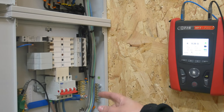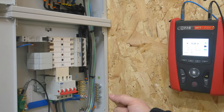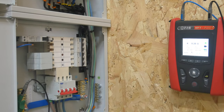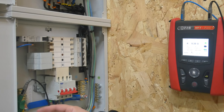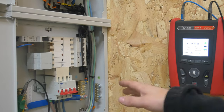It's important you do this with the jumpers on individually, not all together. So don't just clamp all of your L1, L2, L3 and neutral together and stick them to earth. You need to do them one at a time and then make sure, as an extra check, that you've got no continuity. Say you had your L1 and your CPC joined together — make sure there isn't any continuity to L2, L3 or neutral, which I've done.